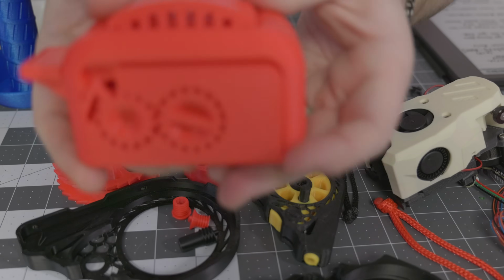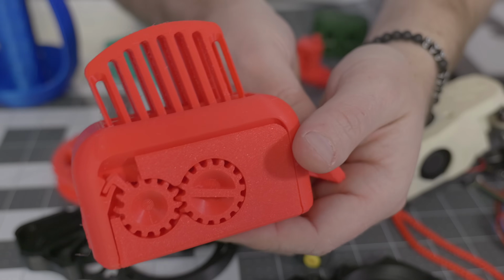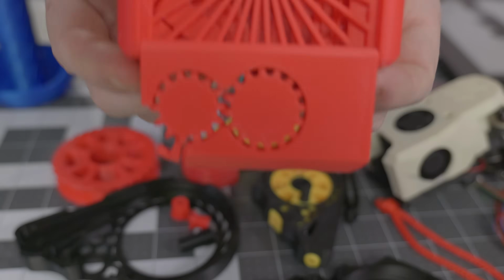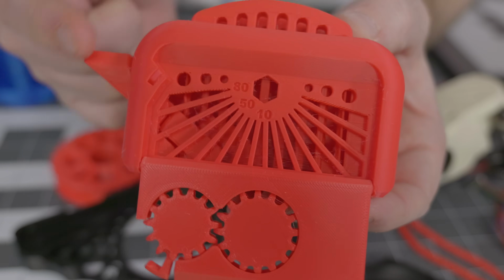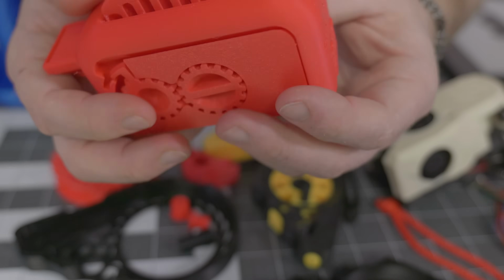Then we get into the Torture Toaster. Like I said, I've been doing these with every other machine that I have, so comparing them makes it a little bit easier. It's the same filament as well. Here you can see very minimal stringing, almost nothing there. Let's start to open the sides here. Here is the overhang test. Like I said, this isn't going as fast as possible, but look at those overhangs. Even with those tiny 30mm cooling fans, this thing just absolutely crushed this.